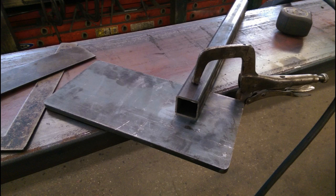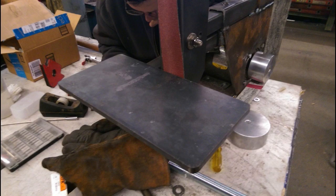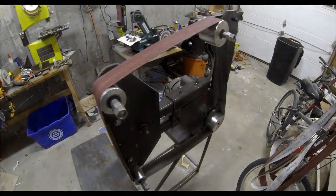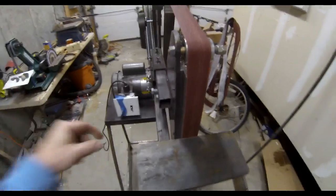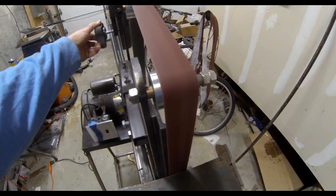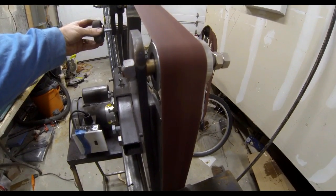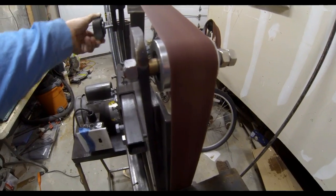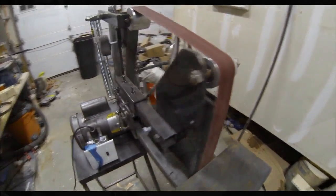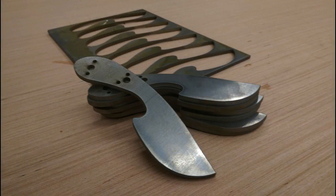One of the last steps was to build the table — very simple: we took a piece of 3/8 steel and welded it onto a piece of square tubing so it slides into either of the corresponding larger tubes. I wanted a slightly larger table because I use a bevel grinding jig and I needed it to slide right on there. This shows the adjustment — I can move the belt from left to right and line it up perfectly with either side of the platen, which is very important when doing plunge cuts.